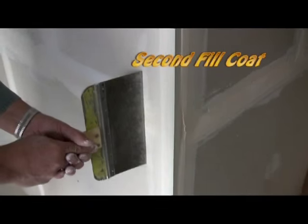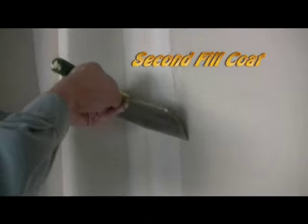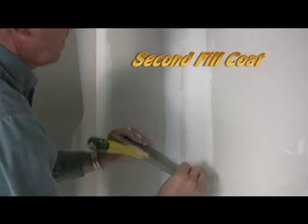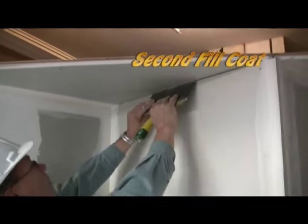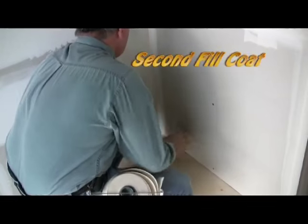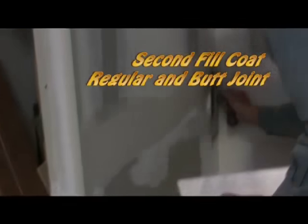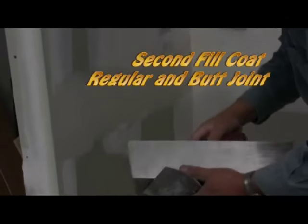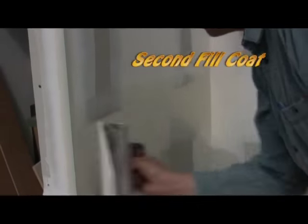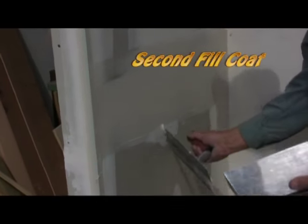Step 4: second fill coat. Ensure all the mud is dry from Step 3. Use the 10-inch knife to level out any mud sticking up or fix a washboard surface. To deal with a washboard surface, draw the knife perpendicular to the ridges and keep scraping till the ridges are gone. If you hold the knife almost perpendicular to the wall, you can scrape off non-level spots quite well. Keep the surface level — don't sand at all at this point. Regular and butt joint: apply another coat that is about 8 inches wide. Draw down the surface with a 10-inch knife or concave trowel, holding it at an angle closer to 60 degrees with pressure as you draw. Try to accomplish this in a single steady but solid pass and avoid getting a washboard surface.